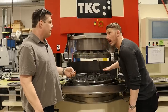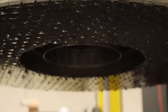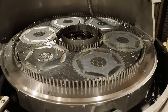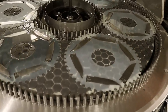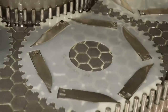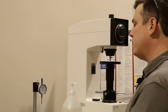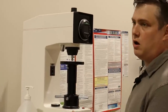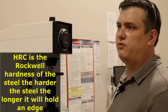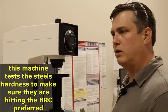This is a giant abrasive wheel, right? Yeah, you have two abrasive wheels — they're spinning — and also the carriers that hold the parts are spinning as well. So this is very efficient on speed and creates really high-efficiency, well-finished parts. And these are blades after it came out right here? Yes, sir. Since we're already over here, this is our hardness tester where we test our Rockwell. Right now we're hitting magna cut at 63-64 for the Maverick. We're trying to raise that for the Bear and the Rock Wall as well.